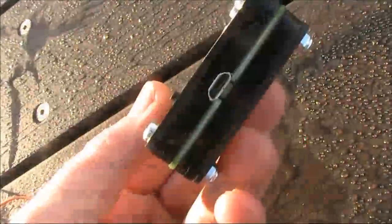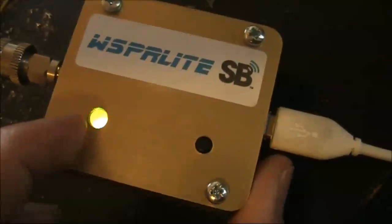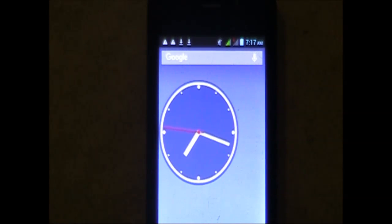This is for antenna, and this is for power. This is a status LED, and this is the switch that you turn on when you want to start transmitting. You do need an accurate timepiece when using the WSPRlite, because every time you apply power you need to press the button on an even minute. If your mobile phone doesn't have a seconds display, you can download a free widget to produce an analogue clock which does. Another thing you can do is go to the website time.is, and that will display accurate time. WSPR requires timing to be within about a second.